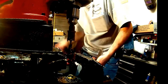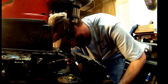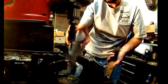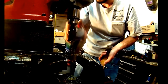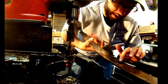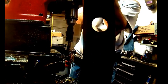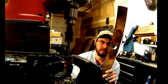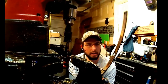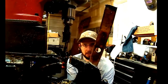So let's try and clean this off a little bit so you can see the nice hole that it made. There's no burr there — you'd have to file a little bit on the backside, but there's not really too much of a burr at all. And this is super, super hard material. Anything normally — you get into spring steel, you're just not going anywhere. You're just burning up bits and trashing bits unless you have carbide. Carbide's the only thing that's really going to get through this stuff.